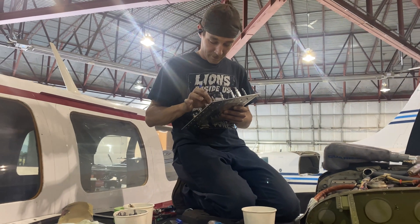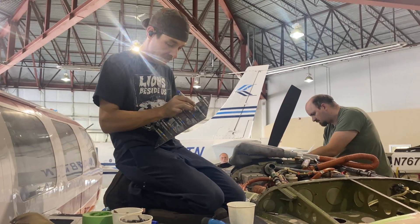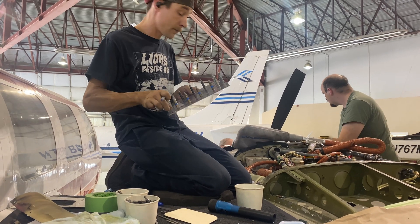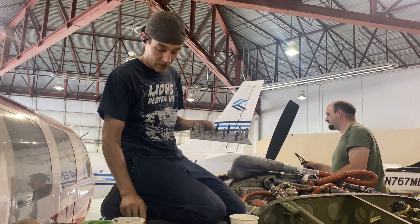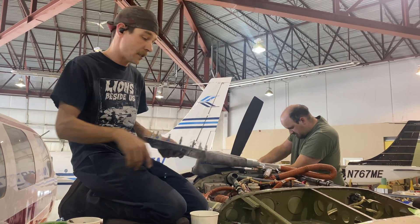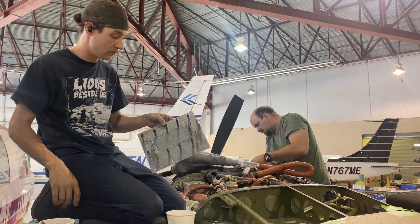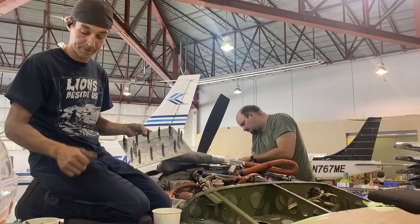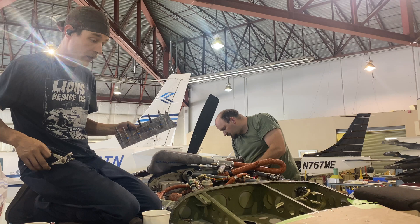So Matt, when you cut in there, what are you doing? I am transferring from the clear plastic to my doubler piece. That's how I picked up the existing holes — with transfer plastic. You throw it down, you can see what you've got, drill right through and match the holes, then throw it onto your plate to make the doubler out of and transfer everything through.